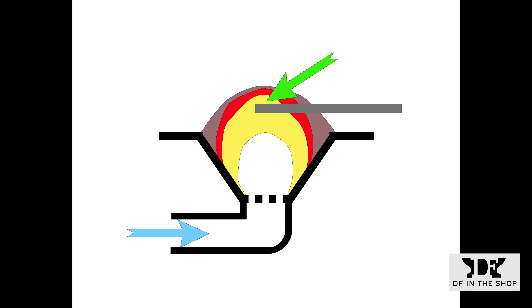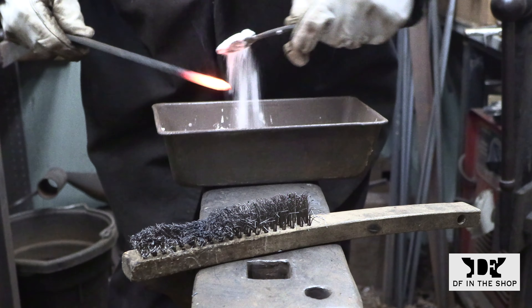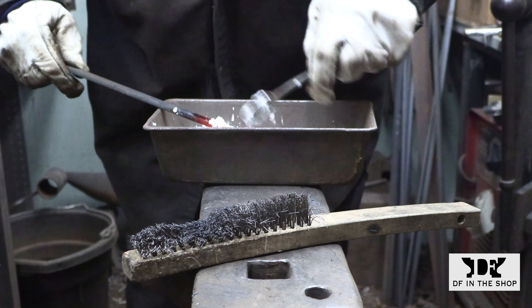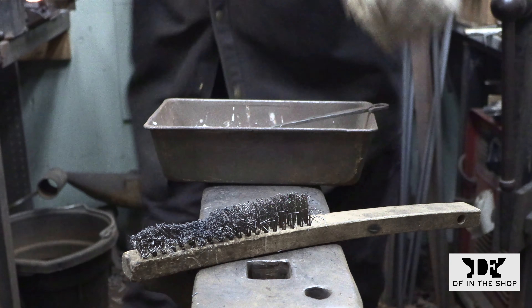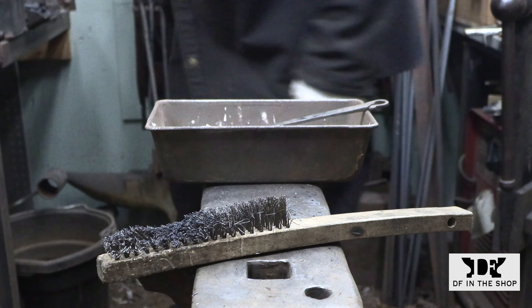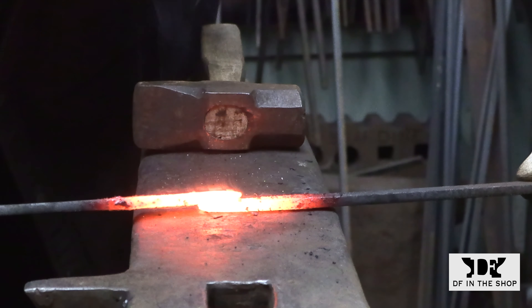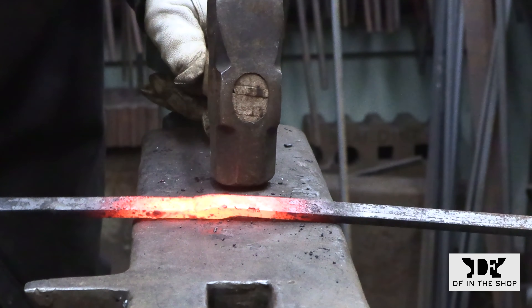In this example I've rebuilt the fire back up to the height it was in the first sample, and I'm going to be working with the bars I couldn't get to weld in the last two examples — just to illustrate that the process is reversible as long as you didn't do any permanent damage to the metal. The only prep work I'm doing to these bars is scraping off all of the old contaminated flux and reapplying the flux, then putting them in a proper fire and just doing the whole thing over again. Coming out of the fire everything looks good, and fortunately this time I'm feeling the two bars grabbing each other. I give them a little tap to reinforce that bond and I know everything's fine.